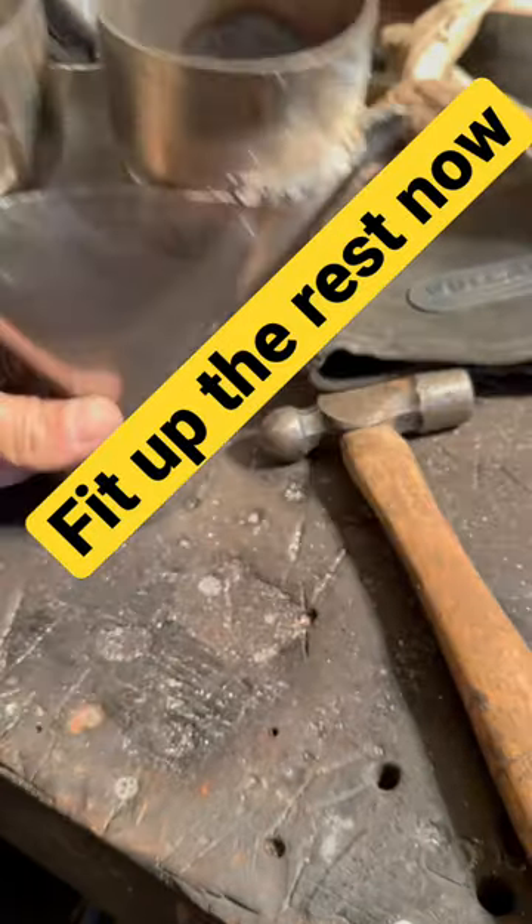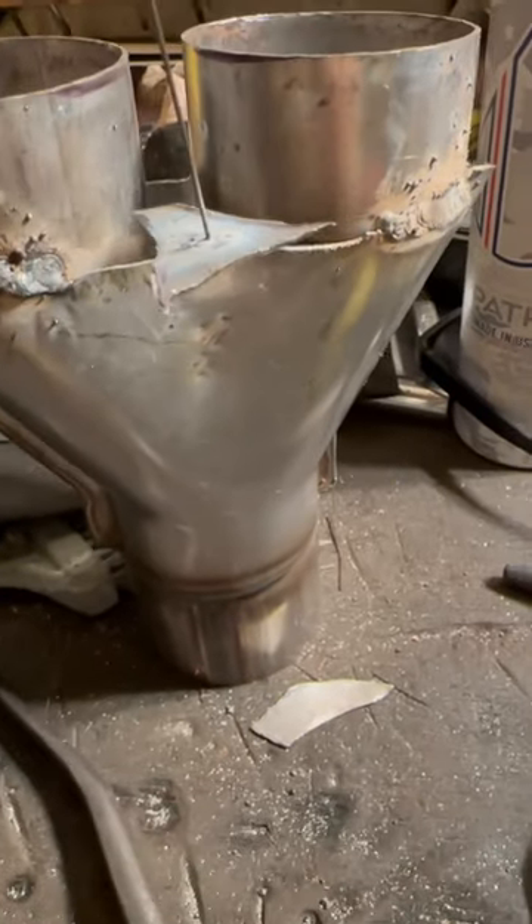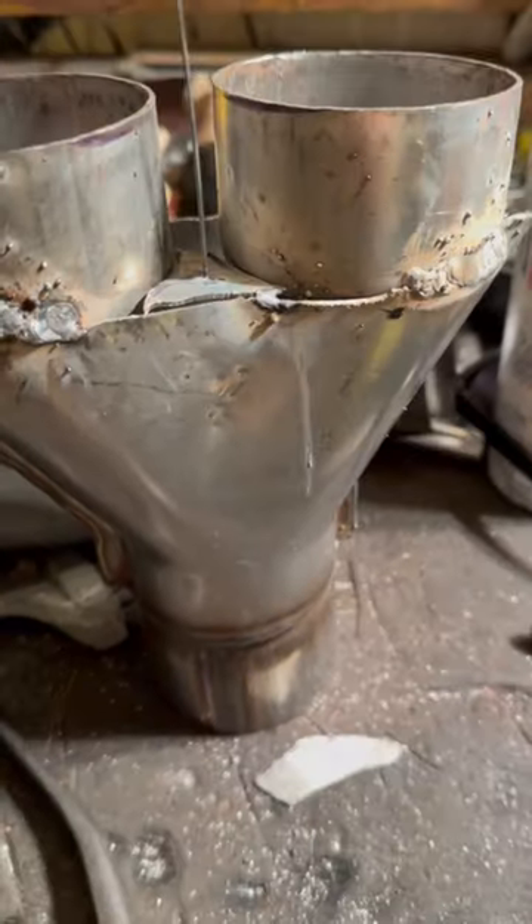Pound it in the contour. Just tack a piece of MIG wire on — it's always available, you'll always have it. It's better than a magnet. Here's your tack.